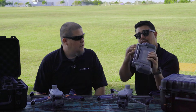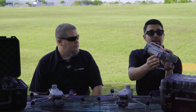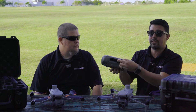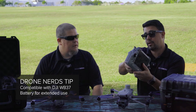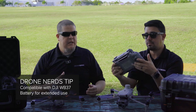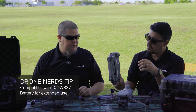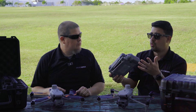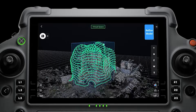They cleaned up where the HDMI outputs used to be in the middle — now it's on the edge. You have your USB-A on the other end, as well as a microSD card slot and USB-C port. You still have a way to use an external battery, so you never have to turn it off. If your remote controller hits low battery on a mission, it has its own internal battery and you can do a quick hot-swap on the RC without going through a reboot sequence. The processing power of the remote controller has also been improved, so you can do way more things on it without needing a computer for surveying tasks on the field.